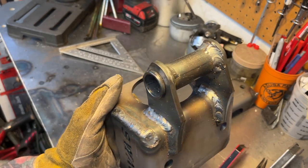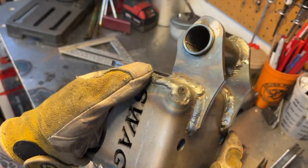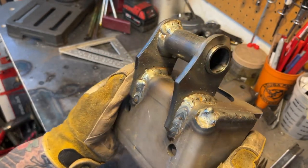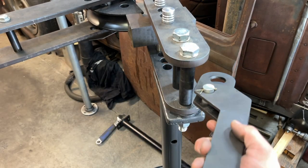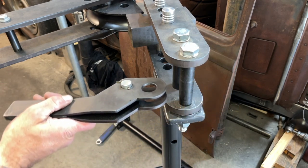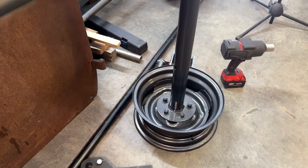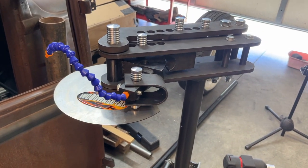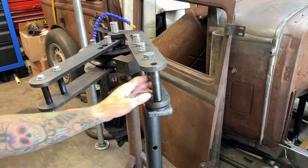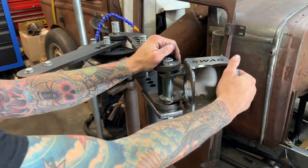I got that all welded up. I opted for welding on the inside right here, just because this is going to be under a tremendous amount of pressure — you've got that hydraulic ram and whatever bar you're pushing through it, so it should be super strong. Now let's go mount it on our tube bender and see what happens. This is the Woodward Fab bender, and right here on the end is where the handle goes. Ordinarily without the hydraulic assist, you would get a giant pipe and try to wrestle this thing over, but with this Swag kit we don't need the handle. When I built this thing, I knew I wanted to do this air over hydraulic assist because there's no way I was going to try to manhandle and wrestle this thing. We need to take this bolt off and loosen the other one to get this shaft out of there and get the new one in there. We'll leave it a little loose for now so we can position this wherever we want once we get our cylinder up on there.